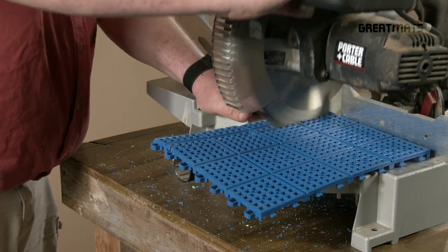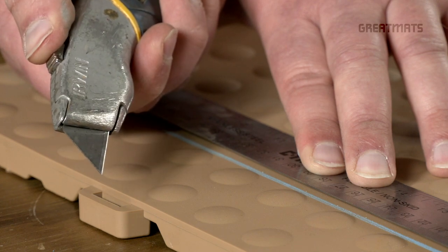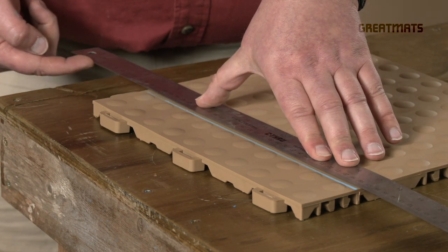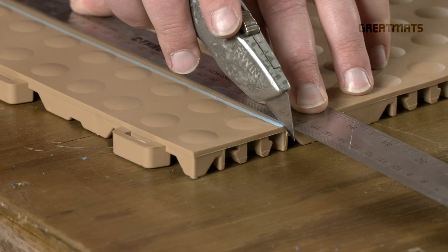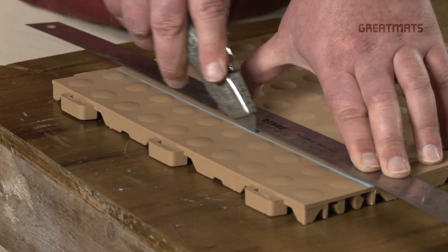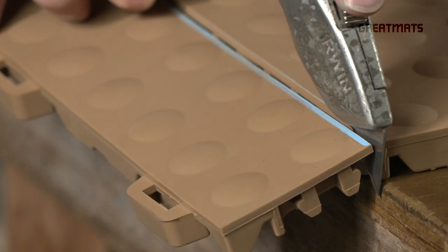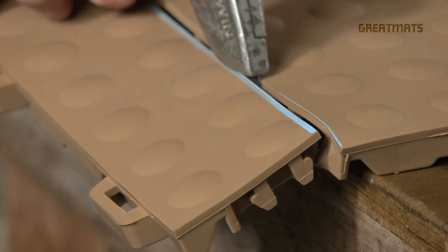We don't recommend any of these saws for corner cuts. Utility knives can be used to cut either straight lines or curves. Once you've marked the tile, align a metal straight edge with your mark. Make sure your straight edge is longer than the cut you'd like to make so you can make continuous cuts. Then follow the straight edge guide, making a series of several scores until you've developed a nice groove. Let the tile either hang off the edge of your workbench at the cut, or place a 2x4 board under the cut to allow the cut to open. Continue to score until you've made it all the way through.